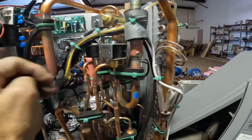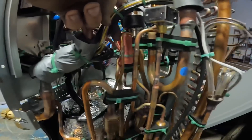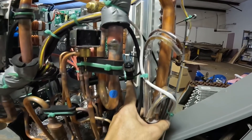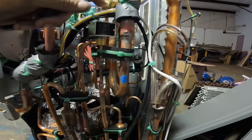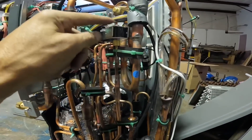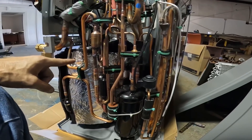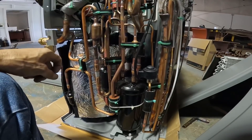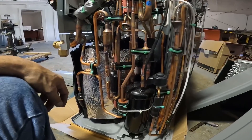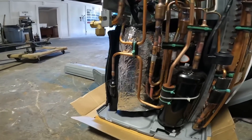Little reversing valve. And here's another electronic expansion valve. And here's another one of my pressure sensors. They do have a magnetic valve in the manual, so that must be that. When it's cold, they use hot gas and feed it back into the compressor to help keep temperatures up, and that allows them to produce heat at very low temperatures. But around here we don't see temperatures down to like negative 22.